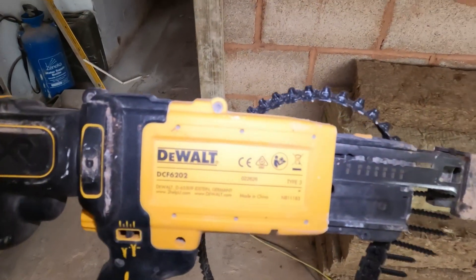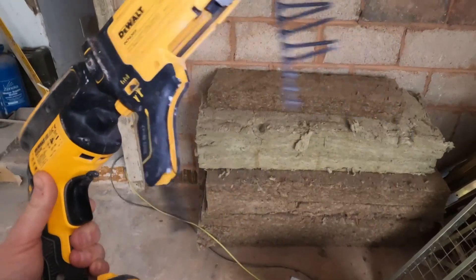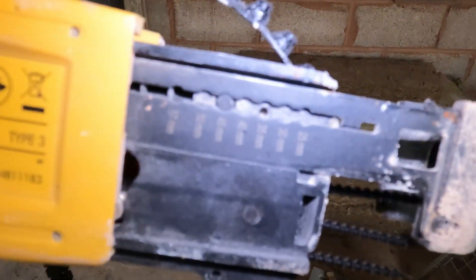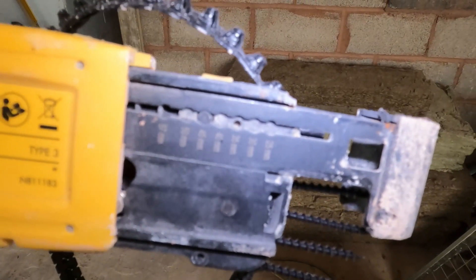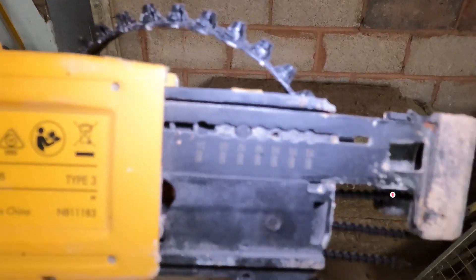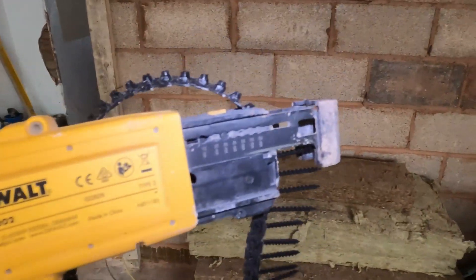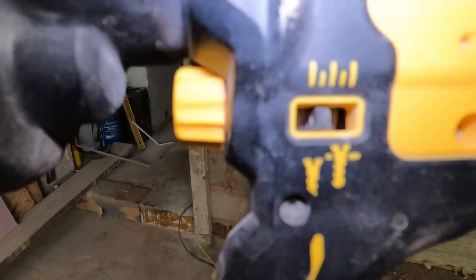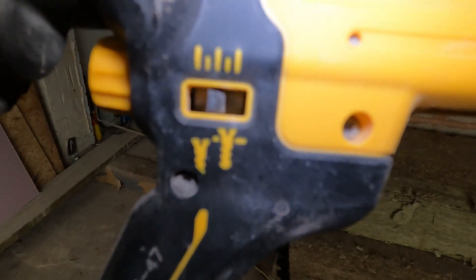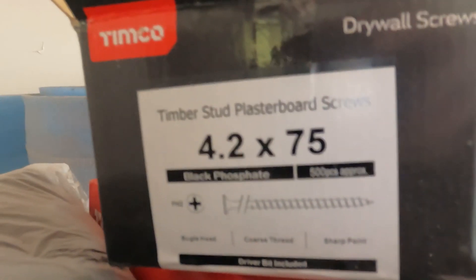As you can see, that's the progress so far. This is the DeWalt DCF 6202 collated gun that we use. For speed, it's brilliant. What you do is adjust the depth — it gives you 25, 30, 35, 40, 45, 50, and 57 millimetre depth settings. You change the depth to suit the screws that you need. When you screw up, you can adjust it so if the head's sticking out too much, you can sink it back. We found roughly the middle setting is perfect.